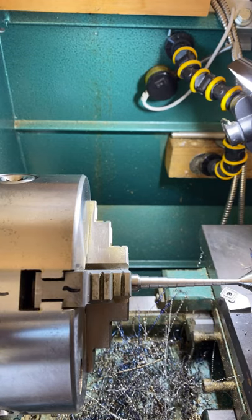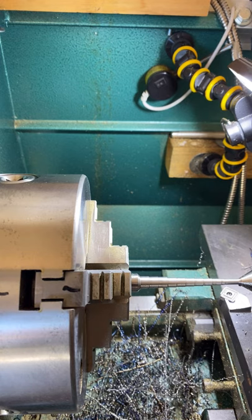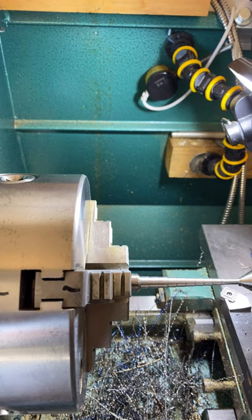So this is going to be the first of a couple of videos showing how to make a backbore reamer, and how to copy a backbore by making the reamer that's the size of a known backbore. I picked a basic short shank C trumpet backbore, because those are quite a bit different than most backbores. They start out shorter, so generally the whole taper is different. You can't really use any other trumpet backbore reamer to make a short shank because you have to flare the big end out. So a new backbore reamer is the best way to do it.